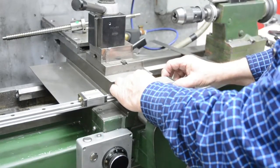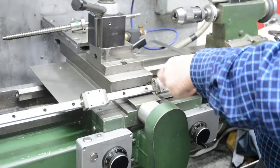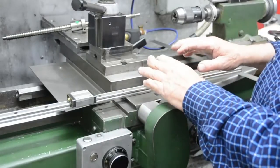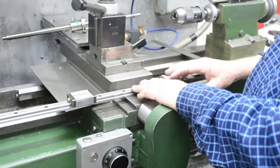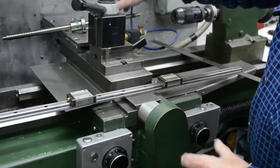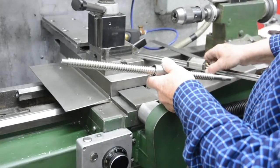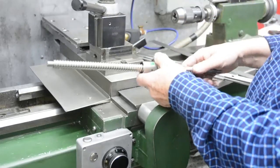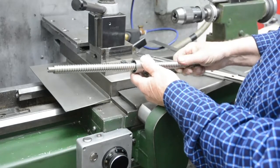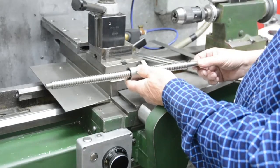You can't feel any play whatsoever trying to twist it. So in general it's a much higher quality thing, and these are also specified as being for grinding machines, so it should be fine. This makes up the other part — we need two slides with two bearing blocks on each one. This is probably something like the lead screw or ball screw that we'll need for the grinding things.